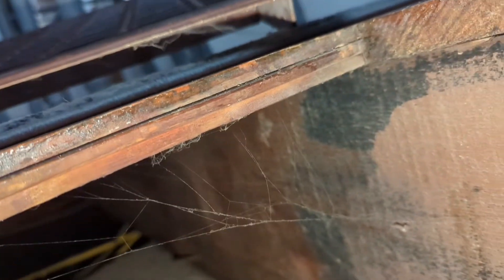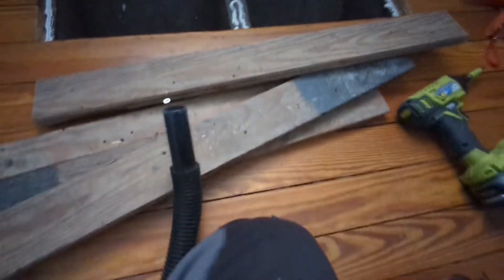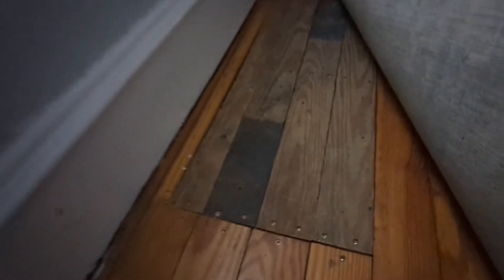Now I'm going to work on covering the whole thing. As you can see, all that nasty stuff was in this floor vent. The plan is to cover this hole since it will no longer be used. First I mark where the joists are to have material to screw the new subfloor onto — I'm calling this subfloor because the plan in the future is to add laminate flooring on top. Next I add liquid nail on top of the joist so there will be no squeaking in the future, then I cut everything to fit and screw everything down.